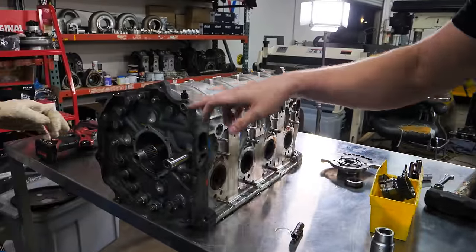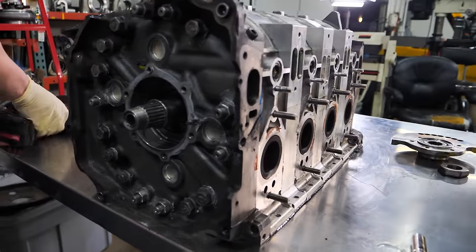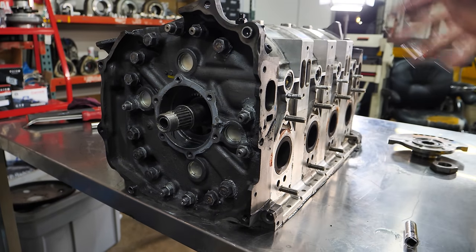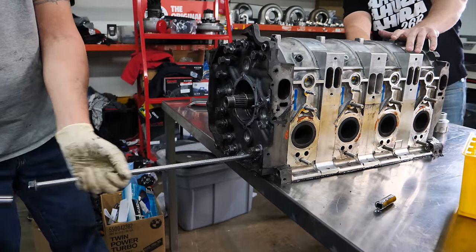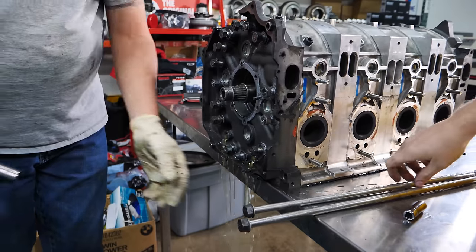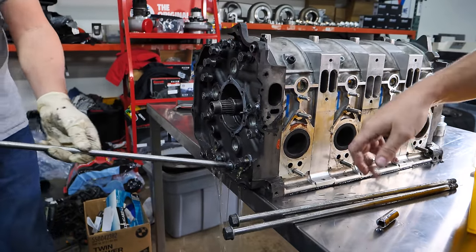How's our first bearing looking? Perfect — beautiful blue, but it's not to the copper or anything like that. There's our front bearing. These are the tension bolts that go through the motor — studs, actually a mixture of bolts and studs. This is kind of the coolest part of the whole build. These are already larger than stock — the standard rotor tension bolts are half-inch or 12-millimeter, and these aren't even the big boys.